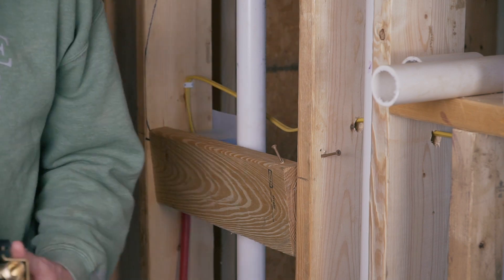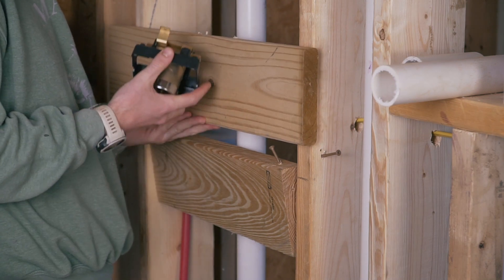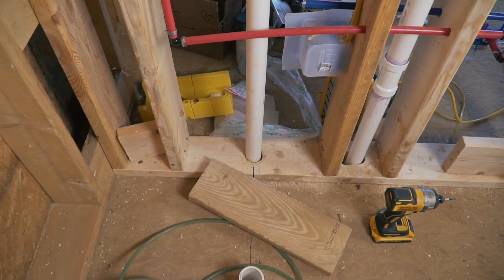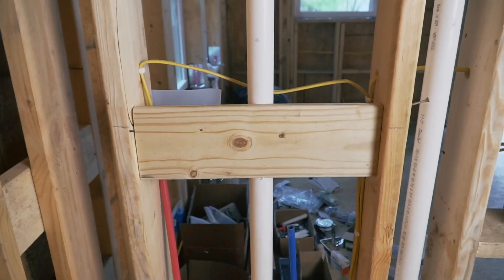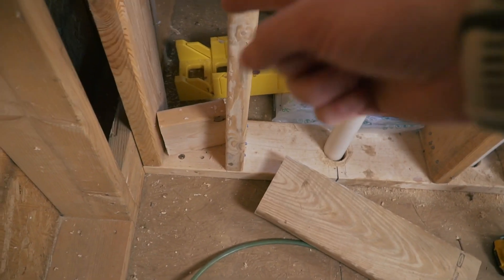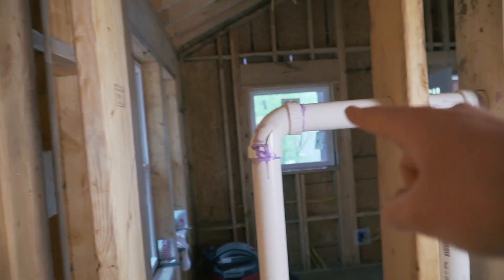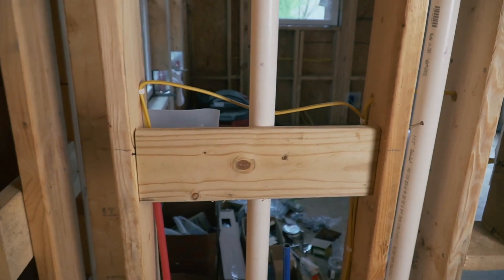Let's try and find out by how much I'm off. This is a one-inch deck board, so that will represent the thickness of the finish wall. I think I found the solution to the mistake. The vent goes directly lined up with the drain, so obviously that's in the way of where my valve needs to go. What I'm going to do is cut this off here, run it 90 degrees at the bottom into the side of the wall, then reconnect it right there. All in all, not too bad of a mistake — easily fixable. I just don't have any of the plumbing, so I'll have to get that.